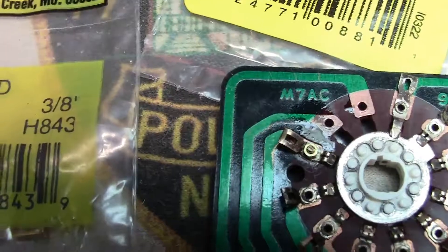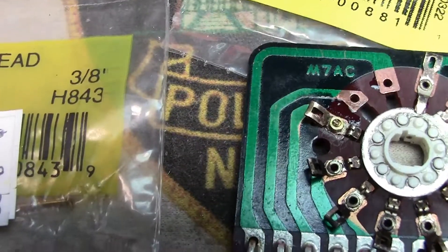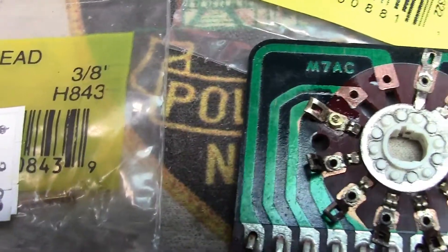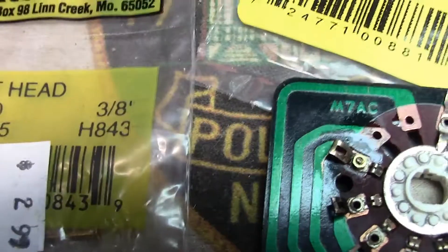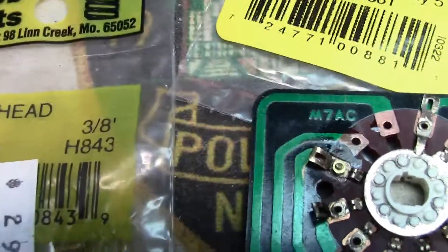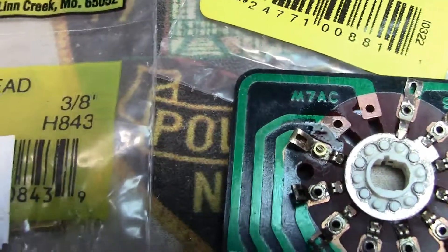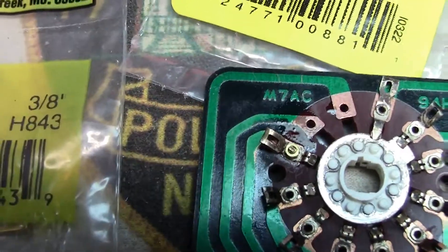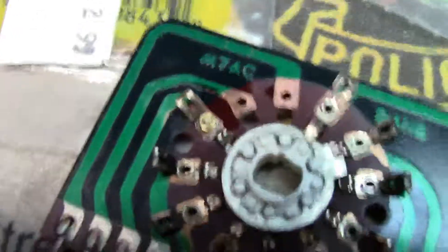That's how you affect the repair: you line it up, screw it down, put a little bit of thread lock on there, and tighten it down — and you've fixed your contact. If you don't do it this way, you'll have to spend fifty, sixty, or seventy dollars for another board when there's nothing wrong with this switch; it can be fixed. The 00-90 screw goes through the contact and secures on the back of the board — you can see the screw head there and the nut on top.